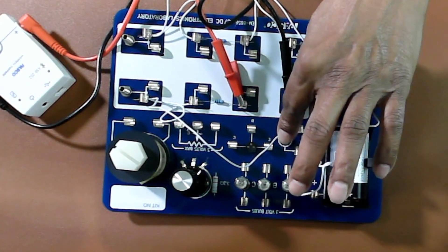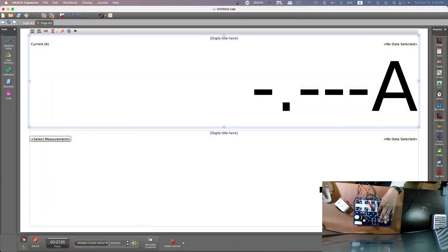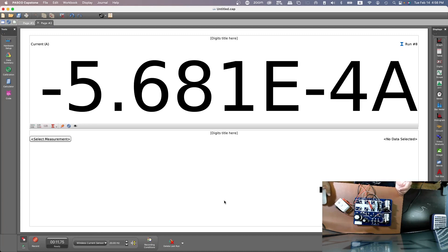To make the measurements, press down on the switch and hit record. It seems to be reading a very small current — it's 0.002 ampere, which is about 2 milliampere. Now to measure the current through R2, remember to put that placeholder cable back first so there is still a circuit path for the current to flow. Then remove the next cable.